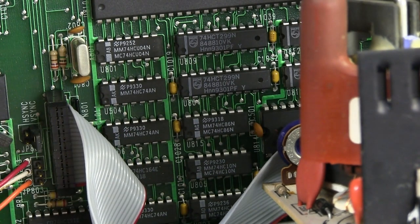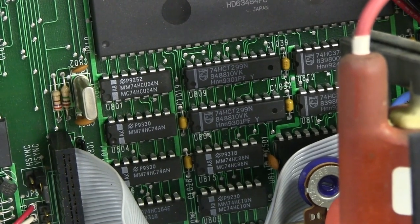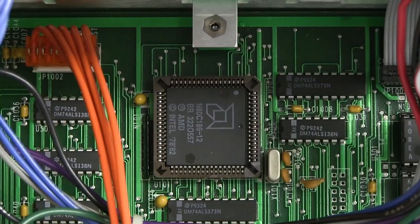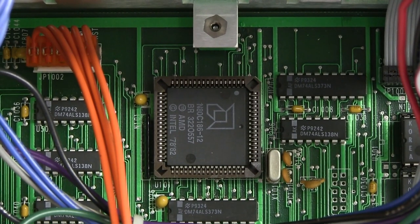Maybe they just delay it by a couple of pixels, or start a couple of pixels earlier, and that's how they shift across the CRT. And there are our dot shifting registers — 74HCT299s. And there's our main processor: Intel 80C186. Brilliant! Of course, it's probably running DOS or something like that, given the 3.5-inch floppy it has. So that kind of throws you at first glance — you think the HD63484 is the main processor because it's coupled directly onto the memory and the ROMs. But the memory and ROMs are actually coupled through to the main 80C186 processor.